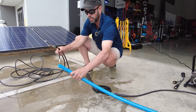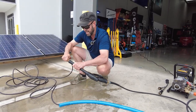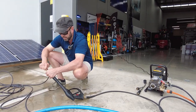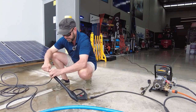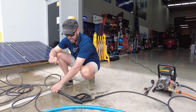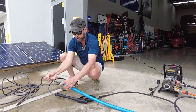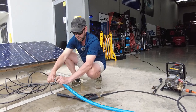With a professional jetting system you would have a mini reel and control it via an on/off ball valve on the reel, along with different cutting heads. With this setup here, we're going to use our pressure gun, which is M22, but it can be coupled to any quick-on or screw-on fitting. So we're going to fire the system up and you're going to watch it pull itself through.